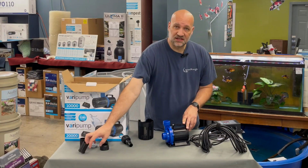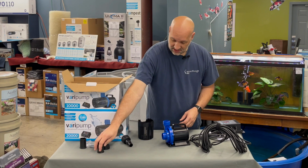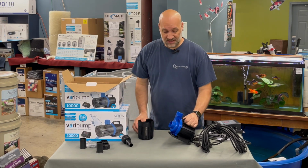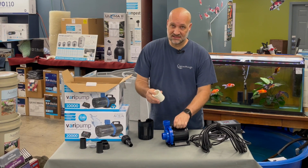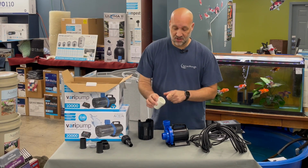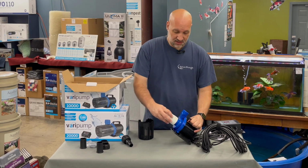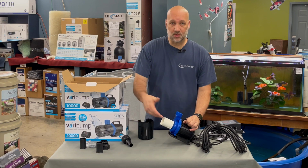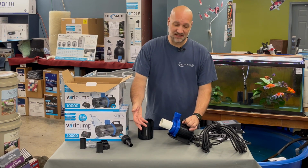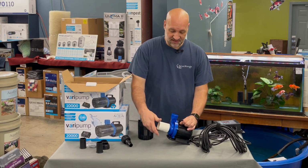Most of these other fittings you actually would not use. They're not very versatile for US fittings. So usually what we would do to connect to the PVC is a fitting like this. This is a 1.5 inch female adapter, female threads on one side, slip fitting on the other. Thread that on, connect the PVC pipe or a PVC bushing, whatever we're connecting to at that time, standard PVC fittings.